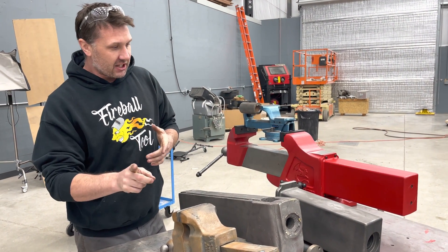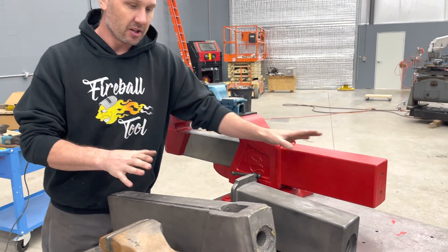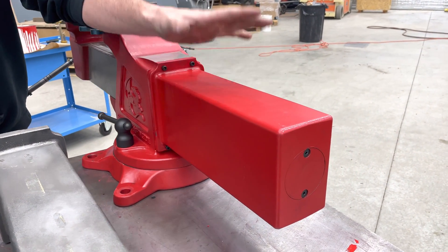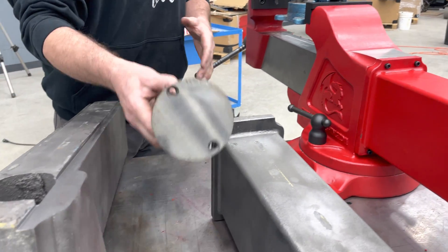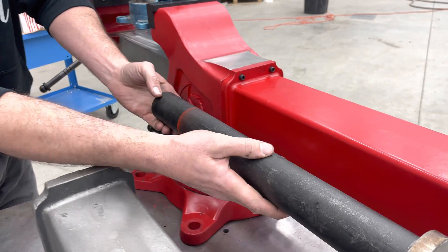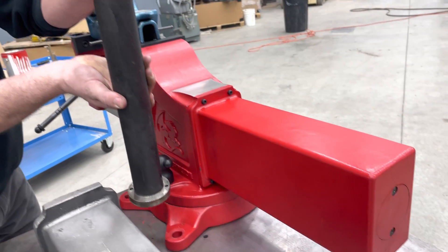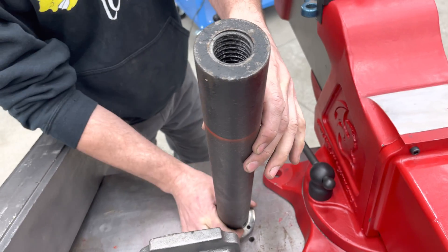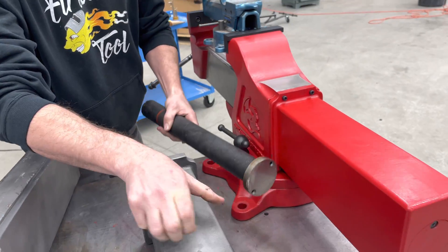The first thing that the hardtail does is that it keeps the slide — the moving section of the vise — clean and clear of grit, grime, and dust. The second thing that it does is it holds the nut. This is a long nut, and it gets mounted to the back, and it positions the threaded section up here in the front. That's actually where the screw is doing all its work, but it's being held from the very back of the vise by the hardtail.